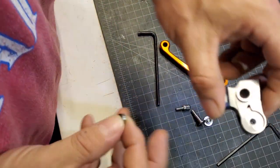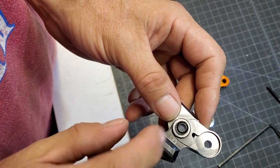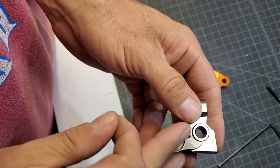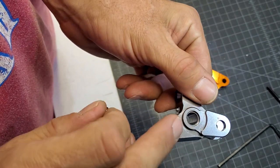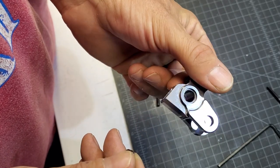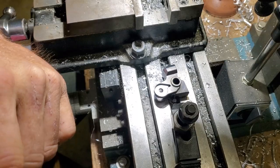I don't have to drill it because this has an insert that you take from it, so there'll be plenty of slack room. I've got a 9 millimeter chucking reamer, so I don't need to drill the hole — all I need to do is mount this in the milling machine and mill with a 9 millimeter chucking reamer, three millimeters deep.